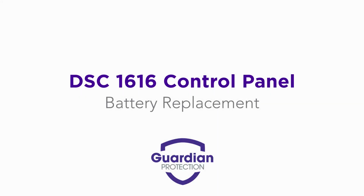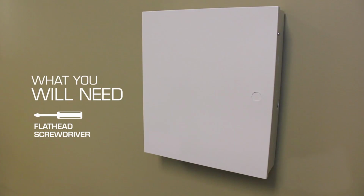In this video, you will learn how to replace the battery in your DSC 1616 control panel box. The panel might be secured with a lock and key or with screws. You might need a flathead screwdriver, Phillips head screwdriver, and pliers.